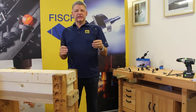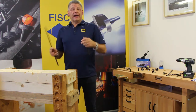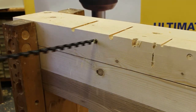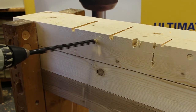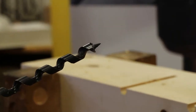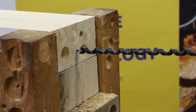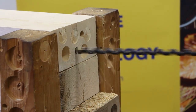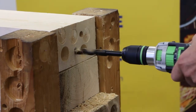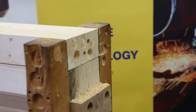This new auger bit is available in various overall lengths: from 235mm, 320mm, 460mm and 650mm, all the way to custom-made bits of up to 1080mm length. Thanks to its special threaded tip, the drill bit is pulled into the wood with little effort, allowing you to operate the power drill with only one hand. Thanks to its sharp grip technology, you can even drill into end grain wood without difficulty. You never have to pull the drill bit out of the wood to clear it of chips — it is self-cleaning and leaves no wood behind on the body.